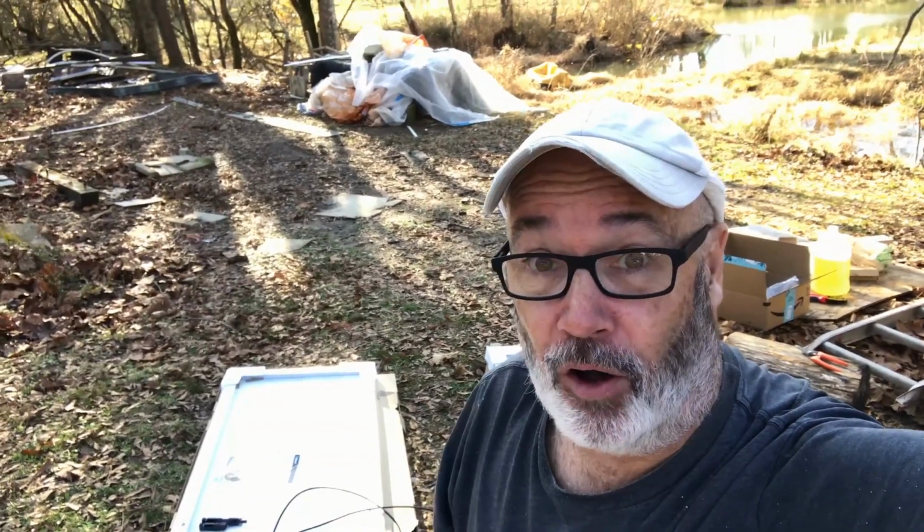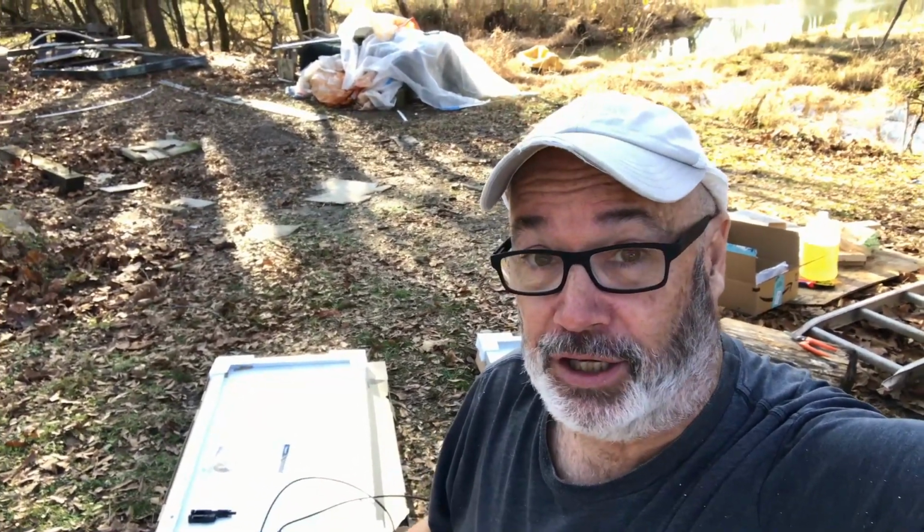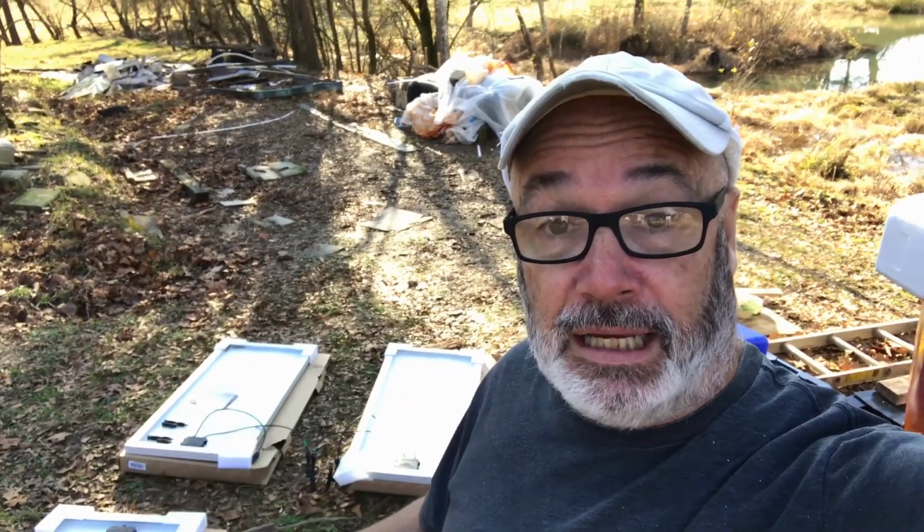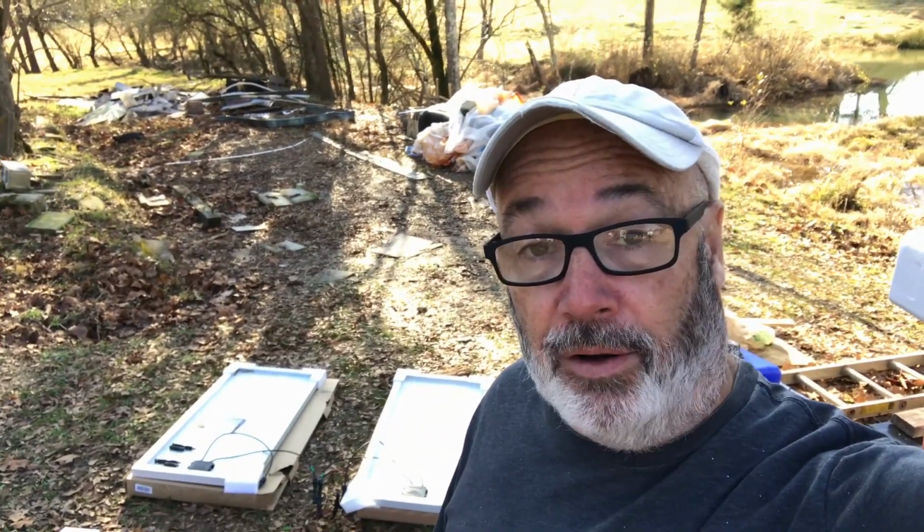In the solar gig, it's going to be 100 watts. That's not going to change. You're not going to increase the amount of voltage. So what you're doing is you're looking at wattages, and that's when you want to run them in parallel. In our case, they're all 100 watt solar panels. They all put out 20 volts of electricity. So we're going to run them in parallel. I'm keeping it simple for me. I have 6 100 watt solar panels that I will be running in parallel.